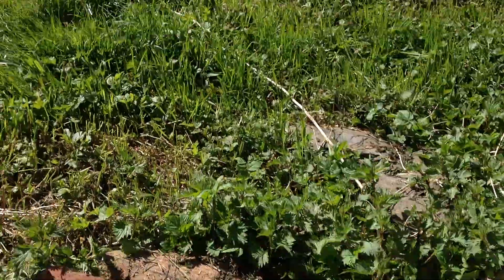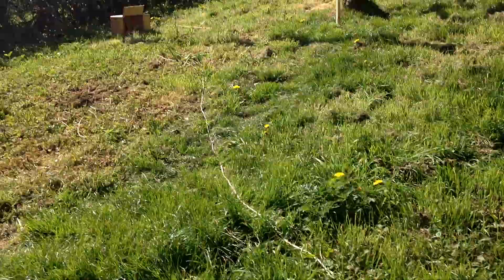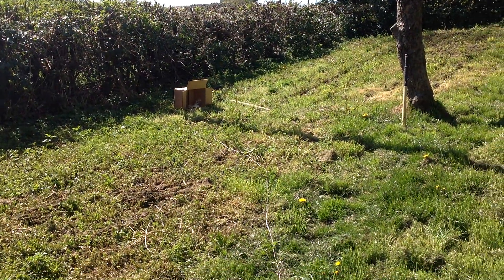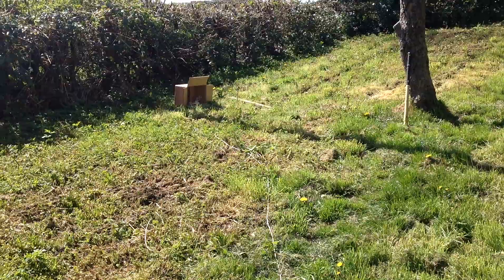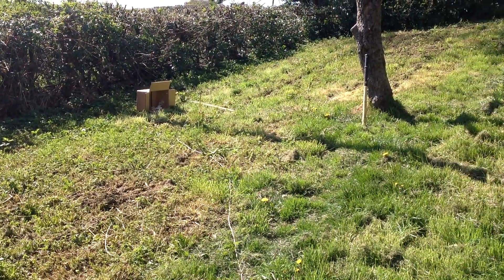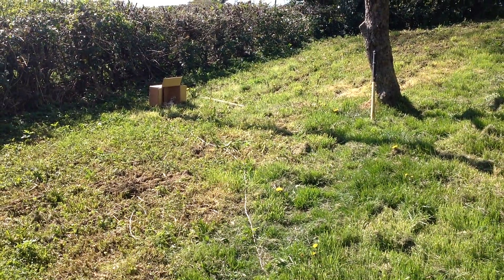The other connection is in series with a 40 watt light bulb in the cardboard box, and then our return path, extension lead, and we have a voltmeter on the thing. I'm going to energize the circuit. Let's see what happens.